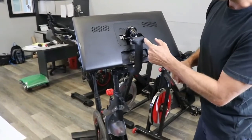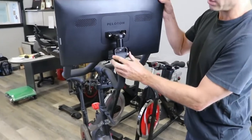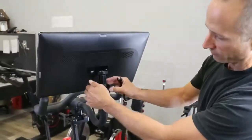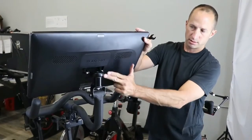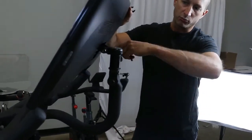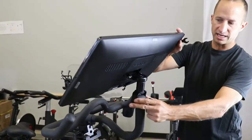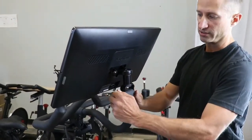You may have some gap in between here — you can put some washers in there. It's not totally necessary, however if you want to use this as another pivot point you may want to add washers there. After you start to snug this up, it is very important to get this aligned with the axis of the arm. You see how this is all in line with the axis? Because when you rotate your screen 90 degrees, it'll make your screen level with the ground, like a picture frame hanging on the wall. If it's not level, you'll really notice it.